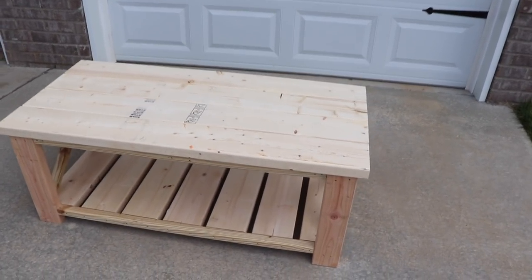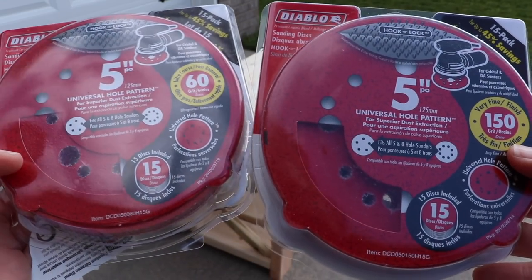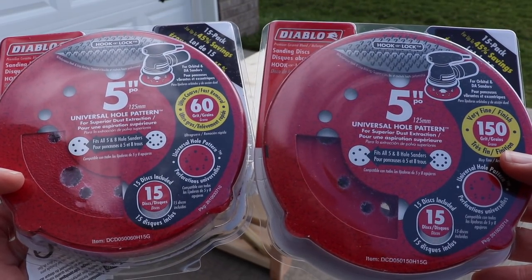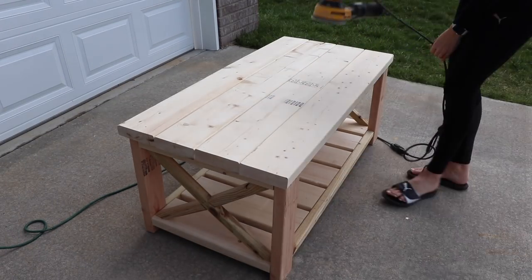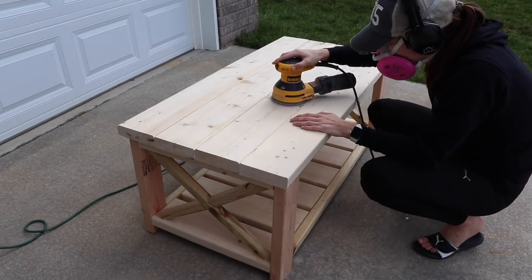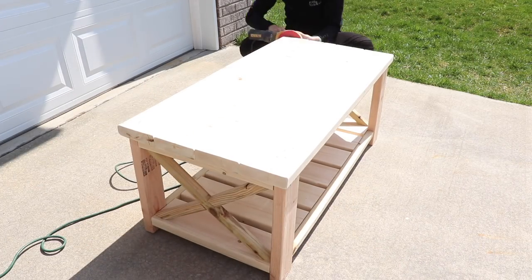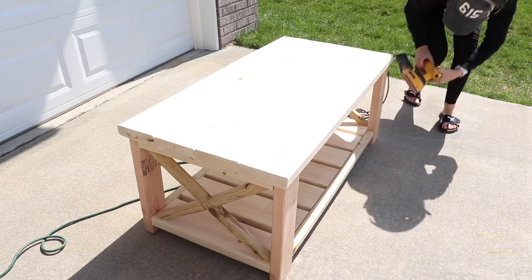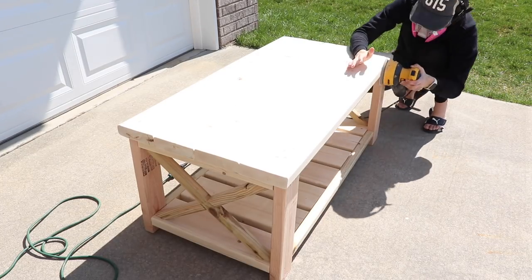Here is what it looked like once he was all finished. My next step is prepping the surface to apply my wood accelerator. I just have a coarse sandpaper and a medium grit sandpaper and I'm using my DeWalt orbital sander. I started with my 60 grit to really smooth everything out and get the ink off of the boards, and then I used it on the sides to really smooth that out so you don't get splinters. Then I took the medium grit and did a little bit more sanding.